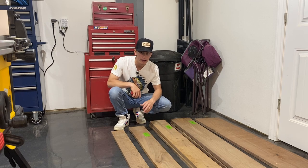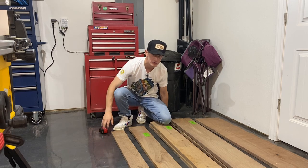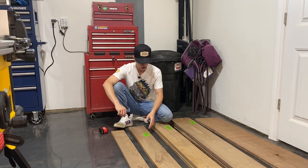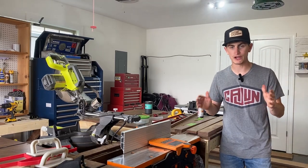After getting to final dimension and squareness, I'll make the final cuts to two and a quarter, one and a half, and one and a half. I'll use the table saw with the straight mill edge running against the fence — that's the straight edge I paid the miller a little extra for, and it's what I'll run against the table saw.